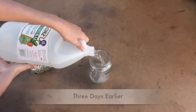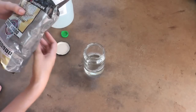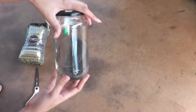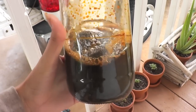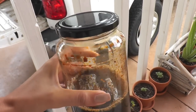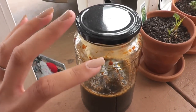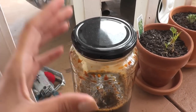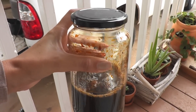I wanted to create an aged, weathered look to the wood. So I used a solution of white vinegar, which I poured into a glass mason jar, filled halfway. Then I used ultra-fine steel wool — I dropped in just one piece; you could unravel it, but I just dropped it right in. I placed the cap back on just lightly — you don't want to tighten it, it needs to be able to breathe. The reaction produces gases which need to be able to escape, so you don't want to have the lid on tight; otherwise, I don't know — it might blow up or something. So be careful with that.